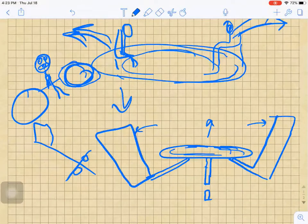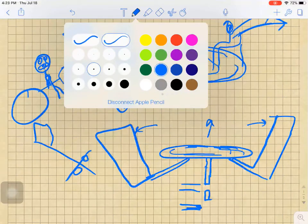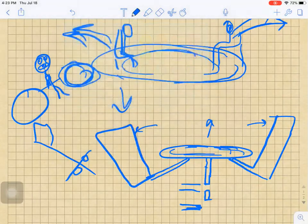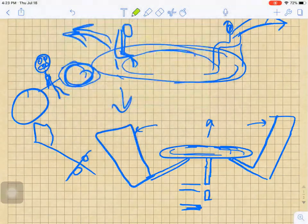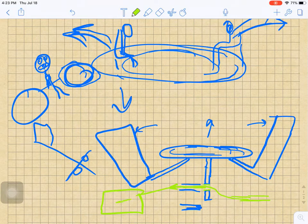So when it pulls up that pilot valve, there's a return line. Let me make it a different color. Alright, let's use green. There's a return line, right? So the return line opens up, and the oil from the hub returns back into the sump, bypassing the engine-driven pump.